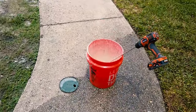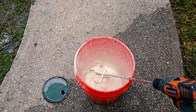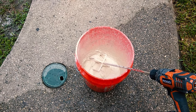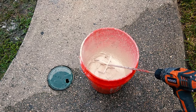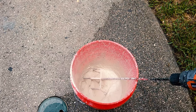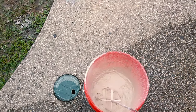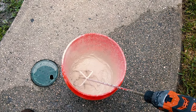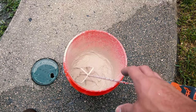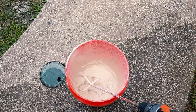The tiles are dry and ready. I'm using a powder-based grout, mixed similarly to the thinset. Grouts are a little different on timing — mix for at least five minutes, then let it sit for ten minutes, then remix until you get it soft enough but not too dry. You want it thick and consistent before jumping into grouting your tiles.